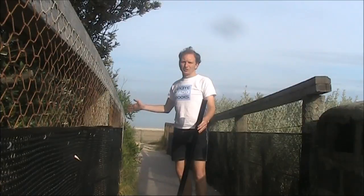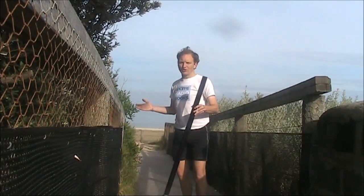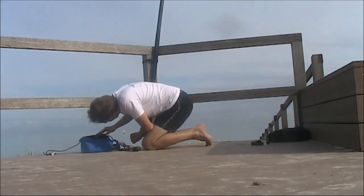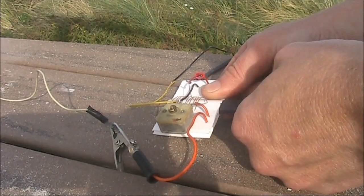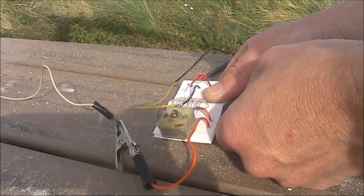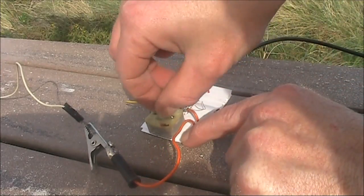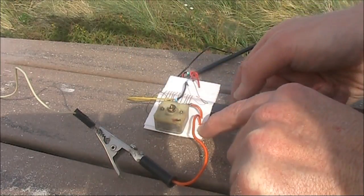Is this coupler any good? We'll find out soon. I'll put up an end-fed wire about 20 metres long, supported by the usual squid pole. You can hear the difference in the receiver noise as I slide the ferrite in and out. Here we are on 40 metres, and as would be expected, the maximum noise is when the ferrite is fully in — i.e. maximum inductance. And we have a peak in about the middle of the tuning capacitor's travel.